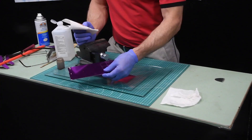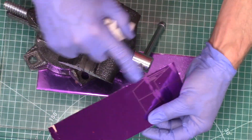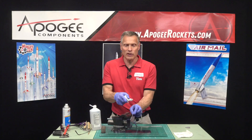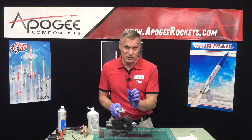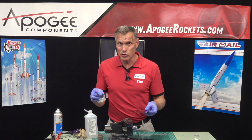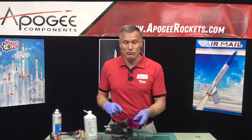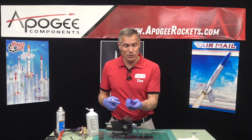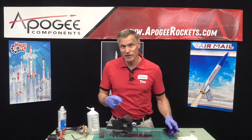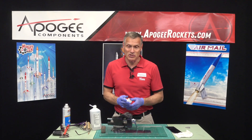This is one that I did yesterday and I can see some little divots on it, but overall the surface is very smooth and this thing is flat like a sheet of glass. That's another advantage — normally your balsa wood can warp over time because of humidity, but once you do this with layers of carbon fiber veil and the foil to keep moisture out, your balsa wood is going to stay nice and straight. I'm going to pause here and we'll be back once this is cured.